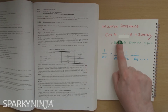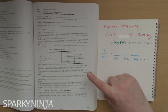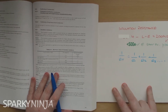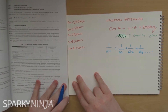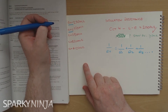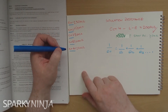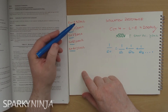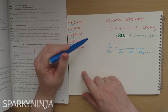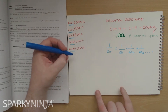I've measured one circuit - yeah, it's really large, I probably wouldn't worry about it, it's 200 megaohms - but the regulation says the entire board. So I need the rest of the board values. Here they are: circuit one 250 megaohms, circuit two 150 megaohms, circuit three 80 megaohms, circuit five 100 megaohms, and circuit six 125 megaohms. Completely made up, but let's work with that. These are the individual circuit readings for what could be a dwelling or a small six-way fuseboard. Now I have all the values I can combine them.